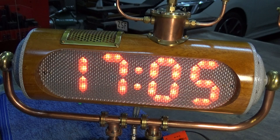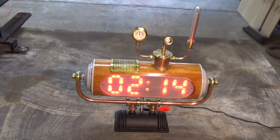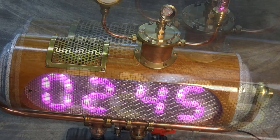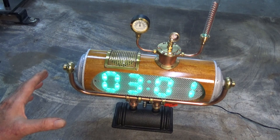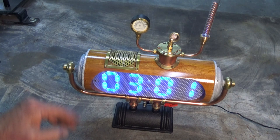Okay, the thing you really want to know is what does the chime sound like. Now I recorded this earlier in the day so the time won't be correct, but you get the idea. So here's a quarter past the hour, half past the hour, a quarter to three, and here's the full hourly chime. The hourly chime increments along with the display. There's a section in the code that turns the chime off at 10 o'clock in the evening and turns it back on again at 8am — you can change those hours if you wish, it simply mutes the chime during that time.